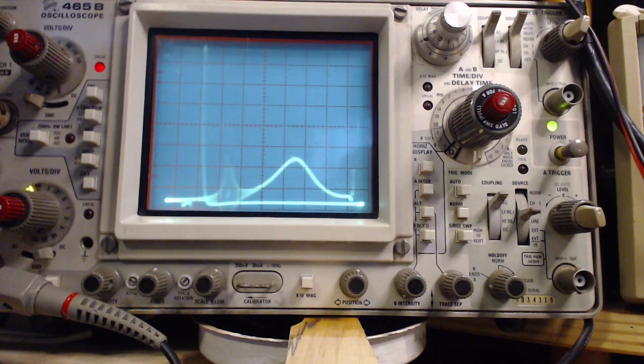There was an instruction about 10.7 — 10.7 doubled would be 21.4. I'm going to set it around 21.4. Based on the dial, I don't know how accurate this is. I don't think that's the sharp marker pip I'm supposed to see. If I had a frequency counter associated with this and could tell for sure what the marker frequency is, then I'd be golden — well, maybe silver, maybe bronze at this point.